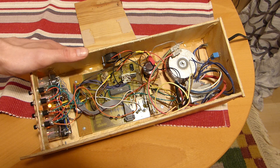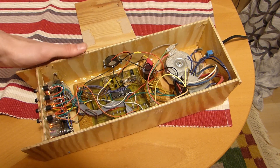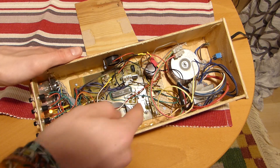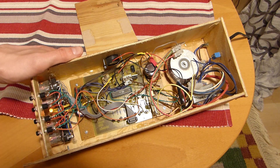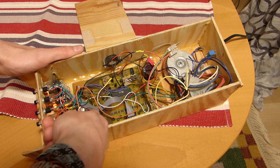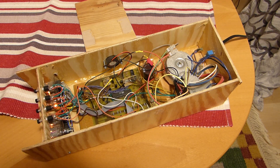So it is isolated from the mains at least. The timing source I used in this one is the 50Hz mains frequency, which I digitized using a comparator here — although I think these ones actually have a built-in comparator, but I found it too complicated at the time to use it. And here there is a 1 farad super capacitor, so it keeps its time if there is a power cut for up to a couple of minutes.